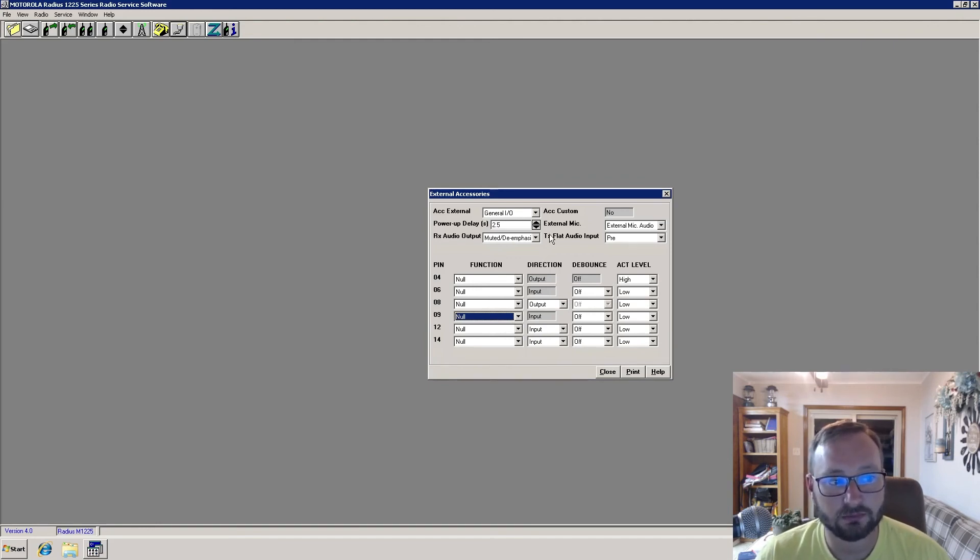If you're wanting to set this up as a repeater, I don't actually recommend it. These are very small chassis and not the most efficient power amplifiers. They create a bit more heat than something newer. When it says 25 to 40 watts, what you'll find is that once you go below 25 watts, you actually start drawing more power the lower you go as you saturate those power amplifier transistors. This is the Radius line — it's not high-end components. These were aimed at being an entry- to mid-tier product, so it doesn't have some of the high-end components you'd find in public safety grade equipment.